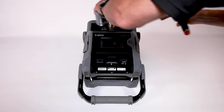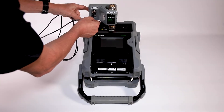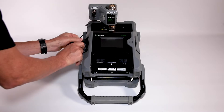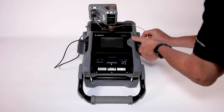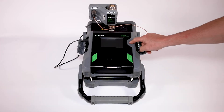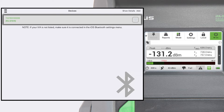Connect the range to fault module RTF to the IPA test port. Connect the USB cable from USB 1 on the IPA to the RTF USB mini port. Connect the RF cable from the monitor port output of the IPA. Insert the battery into the IPA and press the on button.